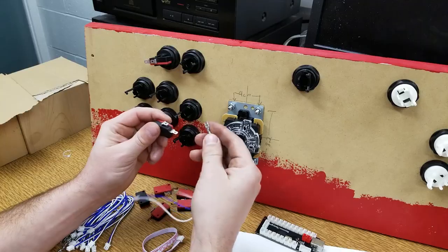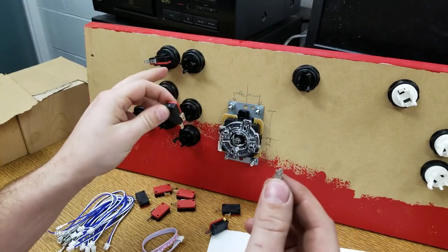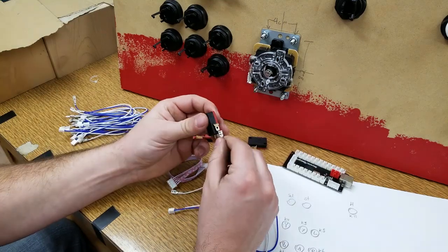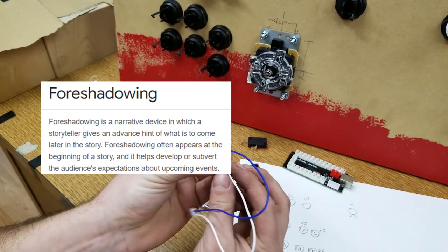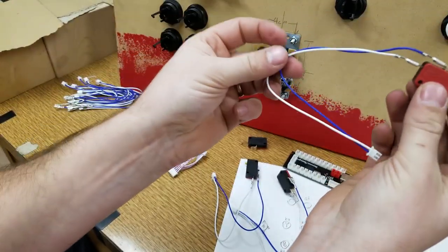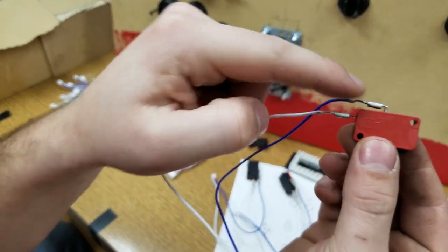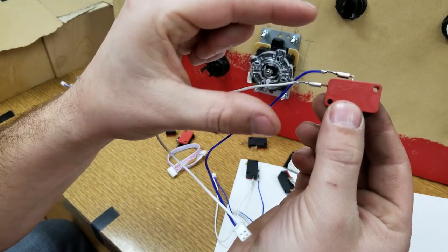I'm going to go ahead and wire those up. I find attaching my cables to my micro switch before I put them on my buttons tends to work a little bit easier — it's easier for me to get things in there. Hopefully there are no broken connections; that's going to be a pain to troubleshoot if needed. It doesn't really matter which color goes where, because when the button is pressed it's going to basically just close the circuit and it's going to work. I only have two choices anyway — I'm just taking wires and touching them, then taking them on and off. That's it.